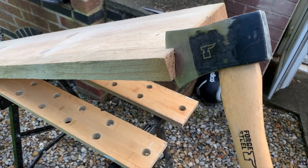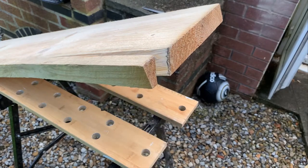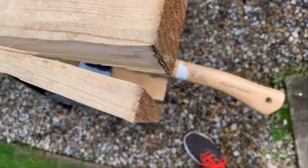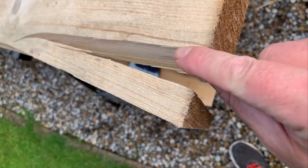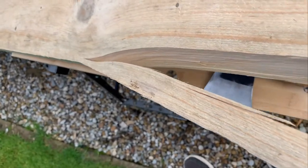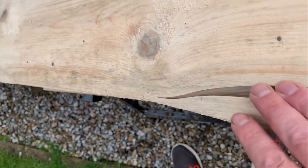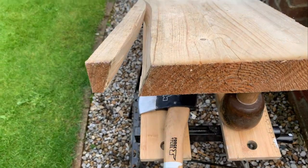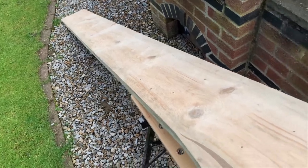As I continue to tap that — there's the first chunk. Let's just have a look at what we've got. Once we've taken that initial bulk off, we could go back in here and take off another few rings if we wanted to. But see how that naturally wants to split and give us that live edge exactly how we wanted it. We predicted it would go with those grains around the knot, giving us these nice sweeps. And if we look at it from the edge, it's not square anymore — it's gone with the growth rings.